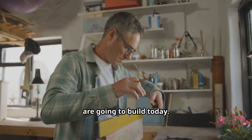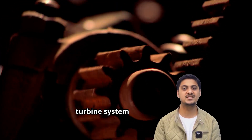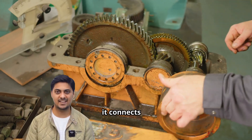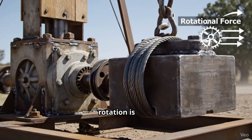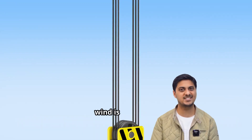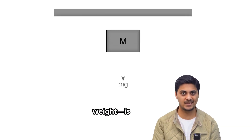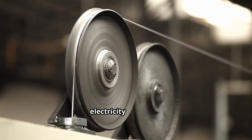This is what you are going to build today. But first, you need to understand the basic mechanics. Your vertical wind turbine spins no matter which direction the wind blows. This vertical rotation travels down a long shaft to the ground. At the base it connects to gearboxes that multiply torque dramatically. This high-torque, slow-speed rotation is used for one purpose: to lift a very heavy weight, converting kinetic energy from the wind into gravitational potential energy. When wind stops and you need power, the system switches modes — the stored energy, that heavy weight, is allowed to fall, driving a separate generator and converting potential energy back into steady electricity for hours.